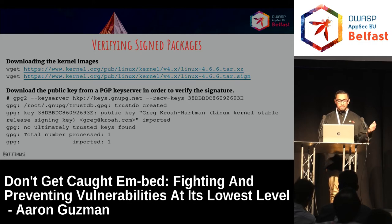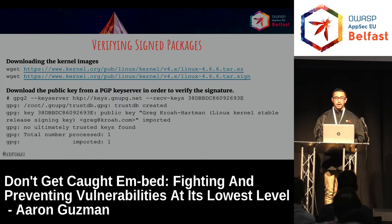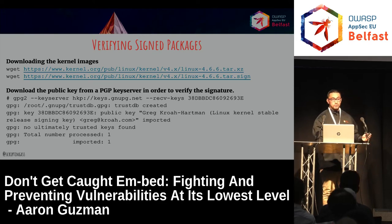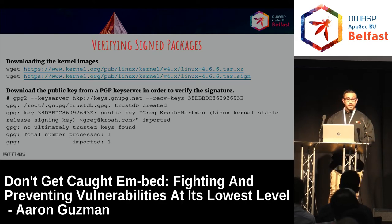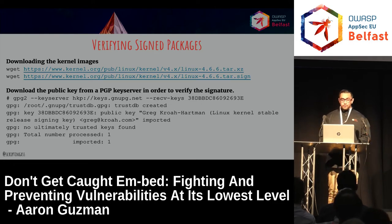Something like GPG for pulling down a kernel and verifying it requires infrastructure — you have to know how to store your private key, how to deploy your public key, and when those expire with a rollback. If you're using Yocto or BuildRoot, they include their own libraries and update them at their own discretion, so it's important to check which version of a library like UPnP they're using — it could be a vulnerable one. Firmware versions should be clearly displayed.